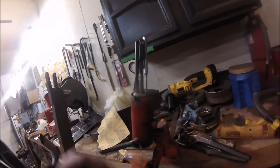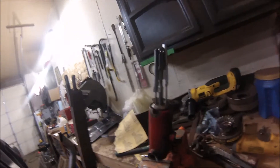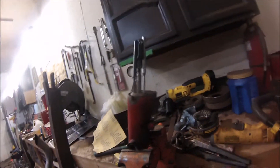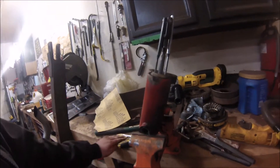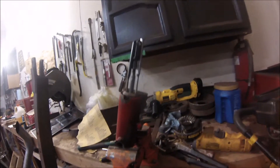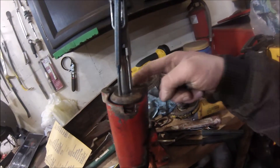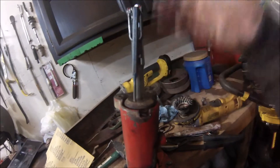I was having a tough time — my snap ring pliers weren't strong enough to get it moving. So what I did was put a couple of punches in it and then use my channel locks, and that actually worked. It's probably not the ideal way to do it, but one thing I've learned with mechanics and farming is sometimes you just got to make something work. That retainer is pretty soft, so once I got it over I just bent it out — now it'll follow along the outside as I turn it and eventually spit out the end.